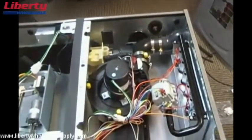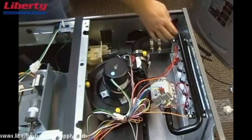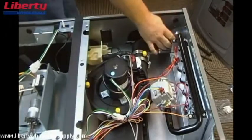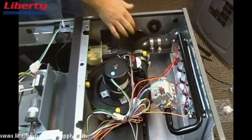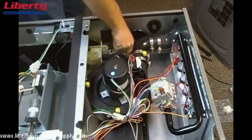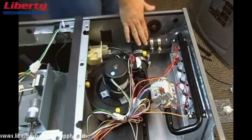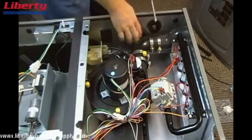The first step in this process will be to remove the transition piece and the elbow. We'll disconnect the tubing from the collector box and from the inducer coupling, and then we will remove the elbow and the transition.